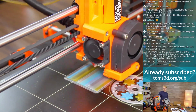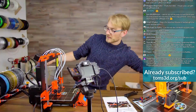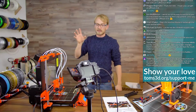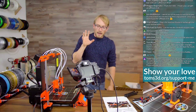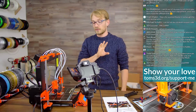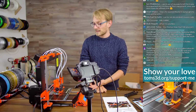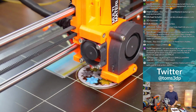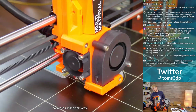We did have a bit of an issue with loading the filament, because apparently it doesn't load all the way in, or something skipped. Probably the extruder just skipped because it was dragging the entire filament rack. The Z calibration prints were not printing any material for the first two or three runs, but then it went fine. It started extruding material. We did the calibration, and after we got Prusa to shut up about following the manual, it is now printing a gear test, a four material test print that was pre-sliced on the SD card. This is one of the included test files.